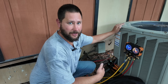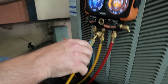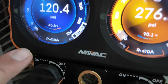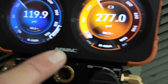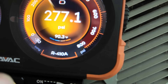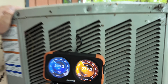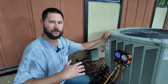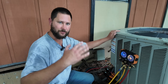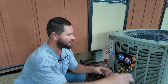Let's get this unit back on. Now we can see the difference in pressures before and after we've cleaned this evaporator coil. Remember, we were at 90 for our low side — now we're at 120. Our saturation before was 27, now it's 40. Head pressure was around 240 — it's now 277. Saturation on the high side was 82, now it's 90. So when we have a dirty coil that restricts airflow, it lowers the suction pressure. When we clean it, we increase airflow and increase suction pressure — and when you affect the pressure on one side, it affects the other side.